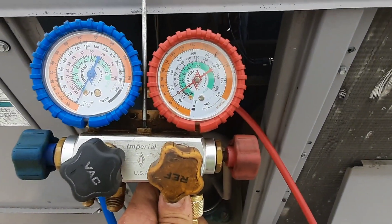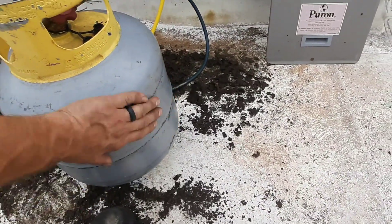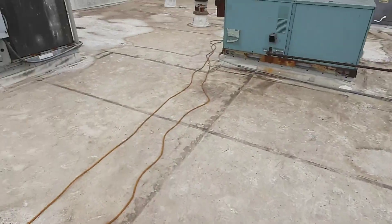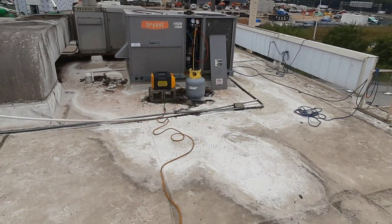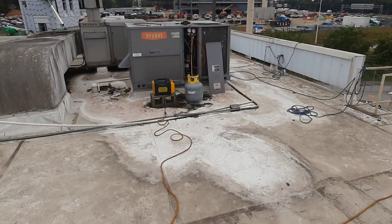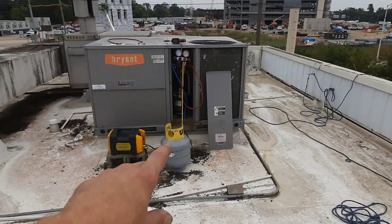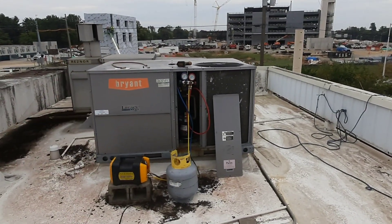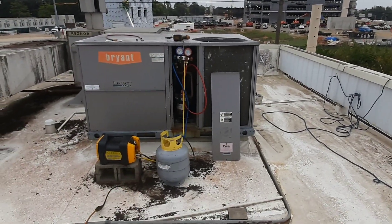It seems to be doing pretty well — I'm dropping pretty good — but it's lowered the temperature of my tank. It's still warm but it's allowing my recovery machine to keep operating. They are demoing this building so I don't have a good way to keep that tank cool. There's no water on site — I'd have to drag up a bucket if I could find some. It seems to be working. It's not a true push-pull since there's no true liquid line on the system, but it seems to be helping me keep the pressure down in my tank.